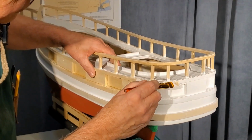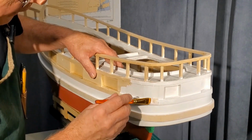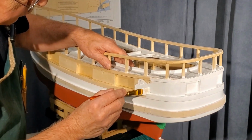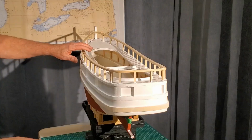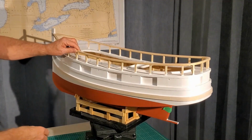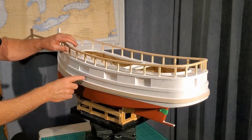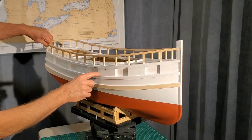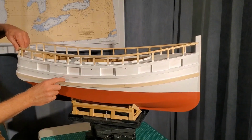So I have that top piece roughly sanded. Now I'm going to coat everything with white latex primer sealer. This will lock all the little wood hairs in place. And here's the first coat of white primer sealer. I'm looking for shadowing here, and it seems to be working. So these indentations here do cast a shadow over that panel, and that makes the shipping door look more obvious.